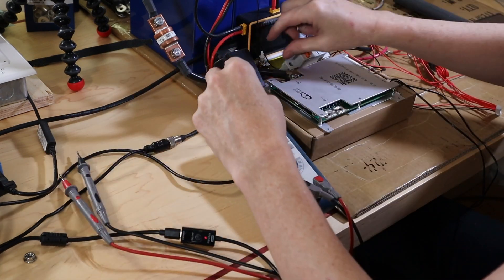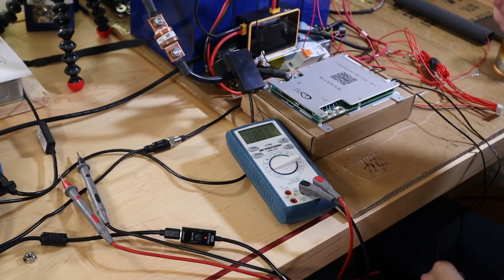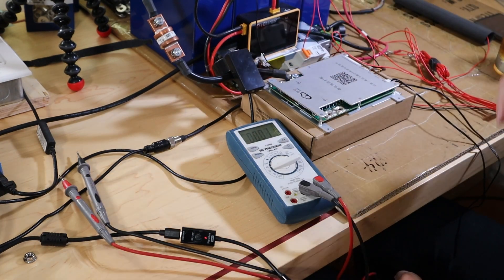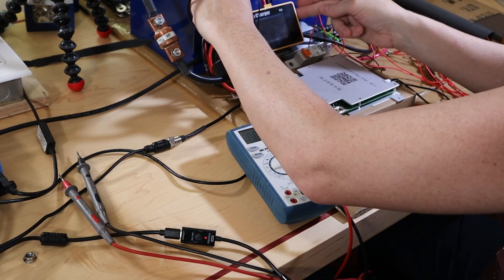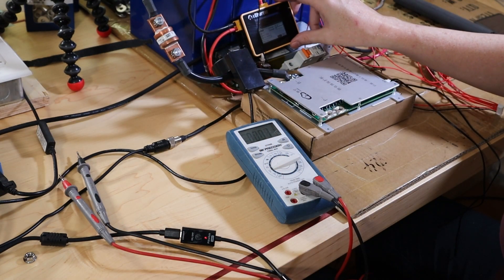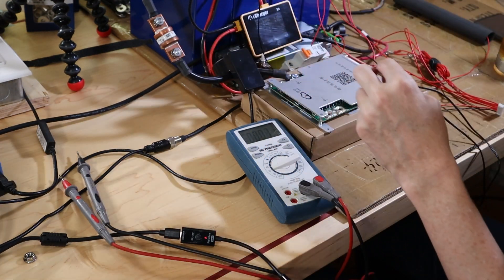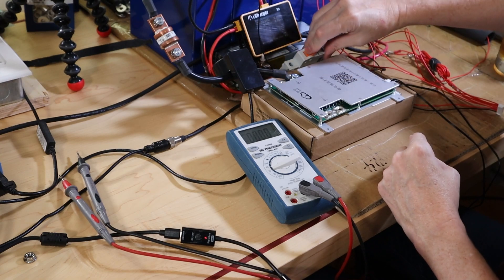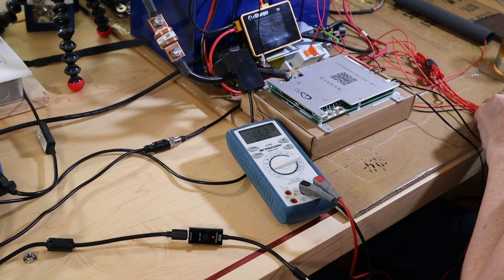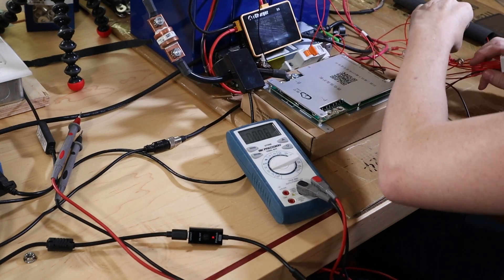So now I should be able to turn on the iCharger. It would help if it was plugged in. I heard the power supply capacitors charge up. I don't remember how to turn this into power supply mode. It remembers 25.6 volts from last time. So this breaker is off — open the breaker. Now I should be able to see 25.6 volts between ground and the last pin. The voltages are right this time. Let's try plugging it in and see what happens.